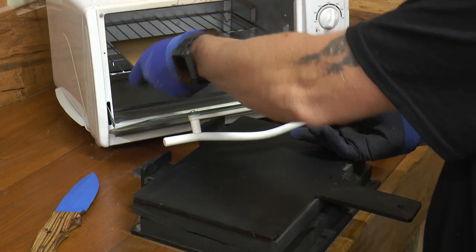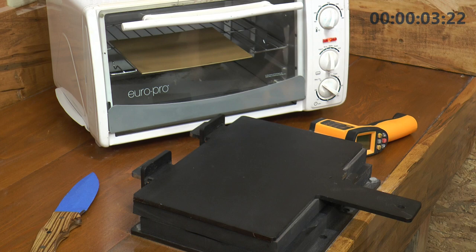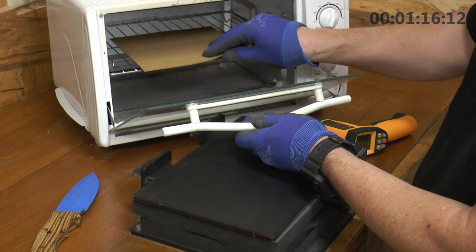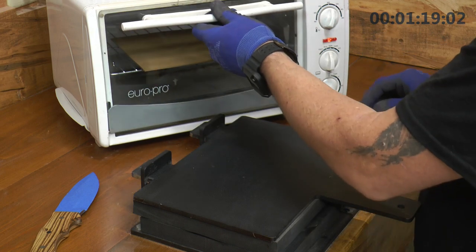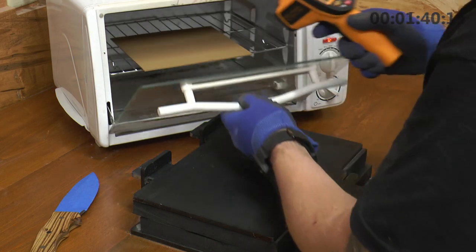There are a couple of ways for you to heat the plastic. Really, the best way is to buy something like a t-shirt press because you get a nice even heat across the plastic. However, they tend to be a little bit on the expensive side. So if you want to stay a little bit less expensive, you can go to just about any store and buy a toaster oven. Do not use a toaster oven that you have at home if you're going to cook in it. Once you heat plastic in the toaster oven, never, ever put food in it again. But this is the most basic, least expensive way to heat your KYDEX, and it will work.